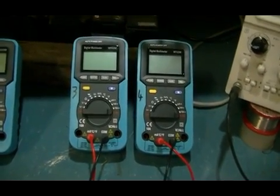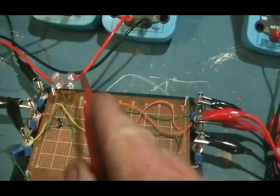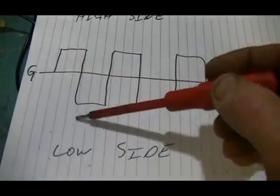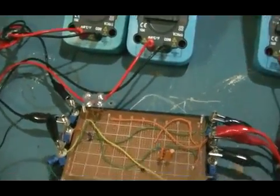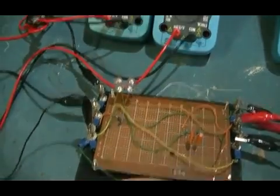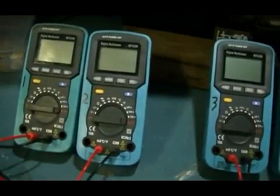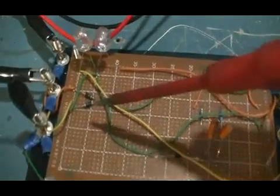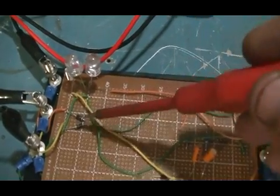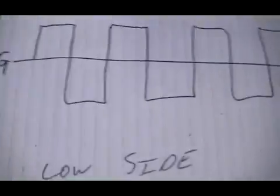These two meters will be doing exactly the same and I've hooked them up the same way as the input so we can compare the two together. Meter three will be measuring the high side going to one LED and meter four will be measuring the low side going to the other LED — two different colors purely for visual so we can see the high side and low side working. The reason we've been able to do that is to use two diodes on the input, one facing each direction, to split the current so the meter will give us the current on the high side and the low side separately.